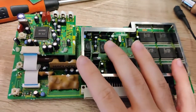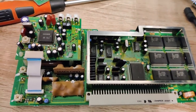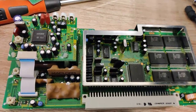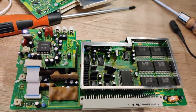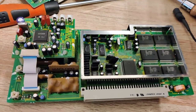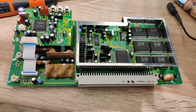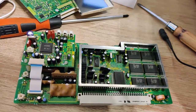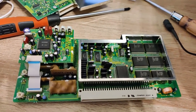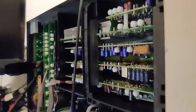This is simply for digital still frames, and this machine came out of a physics laboratory where it was used to capture still frames of measurement equipment, to document measurements. This is precisely what this unit was intended for, and also medical imaging, and the digital still frames help immensely with that, because if you do that on a normal machine without digital still frames, you are gonna get picture noise even if your machine is perfectly calibrated.